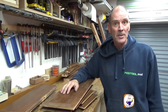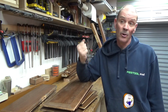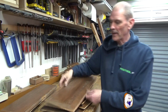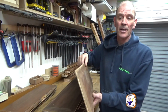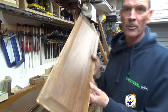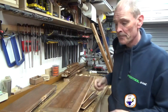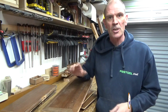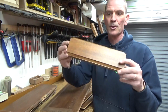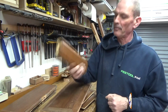So after about 10 minutes of chopping, I used the bandsaw, but you could quite easily have used a jigsaw or even a handsaw. Once you cut through the main struts, all these panels, none of them were stuck in, so they just come apart. And what I'm going to do now is, because all of these panels have got at least one straight edge, I'm going to run them through the table saw and square these up into just pieces of wood. Same again with all of the struts. They've got at least one flat edge, so I can chop them off.